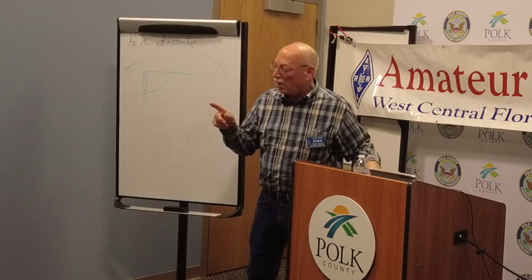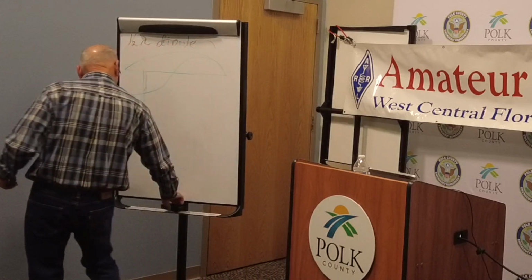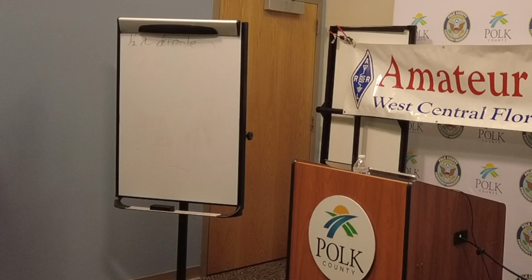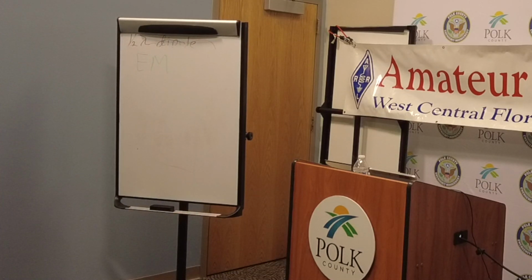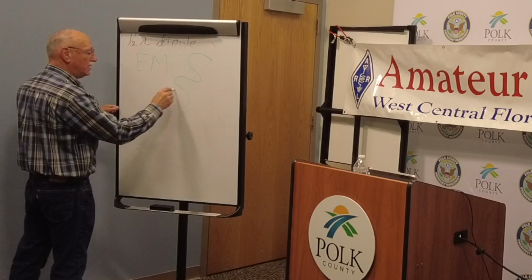Okay, what did we call this wave back a while ago? Sine wave. And what are light and radio waves made of? What do we call them? Electromagnetic wave. And that includes light, includes our radio waves, up and down the frequency spectrum. Electromagnetic. There's an electric field and there's a magnetic field, and they run orthogonal to each other, 90 degrees out of whack.